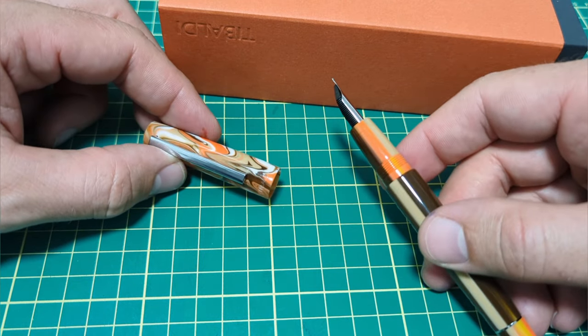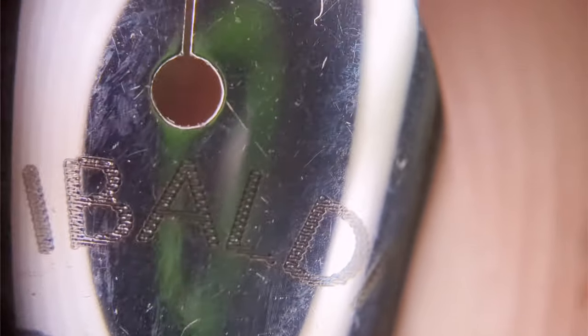Here's a close-up of the nib and engraving. Because of my short working distance with this lens I had to pull the nib and feed out. You can see the 'B' stamped in there, and the laser engraving of the logo — it actually looks like it may be an XY-style laser engraver based on those lines, versus a galvo-style laser that uses two mirrors in tandem. Under the microscope the tine gap is absolutely bang on, there's no canyoning on the nib whatsoever, alignment is perfect, and the resin shows no bubbles — it looks very well done.